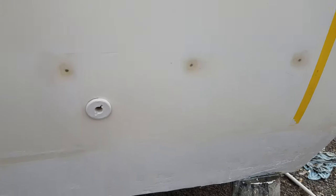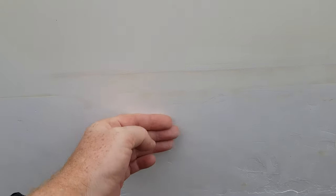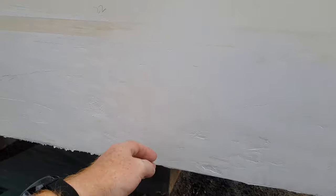I've just started working this section before we had a lunch break. The trick basically is to wet the surface and use the reflection as a guide, because the unmolested sections of the hull when they're damp you can see the line very cleanly. It's just a matter of carrying it on down and then when you get to a certain point you can just feel it - feel the low spots or high spots - so it's just a matter of getting the high spots down and then going back to fill the low spots.